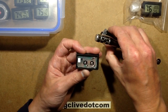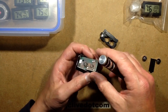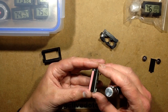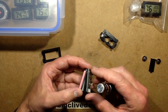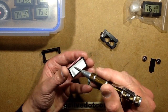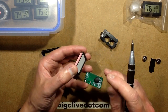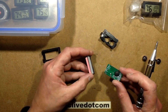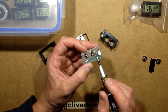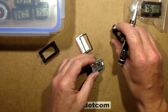If you open it up inside, there's the usual little arrangement. You've got the circuit board, you've got an LCD display with the zebra strip onto it — which is a sort of alternating insulating and conducting strip that transfers the contacts on the circuit board onto the transparent conductive layers on the LCD panel. You've got the usual blob chip, and then you've got two sensors: the temperature sensor, which is a little bead thermistor, and then the humidity sensor.